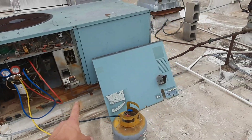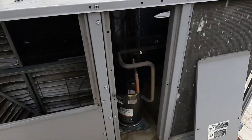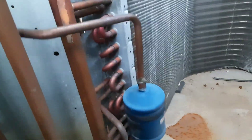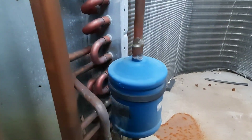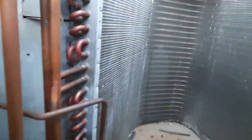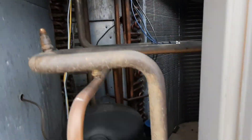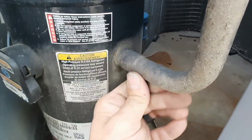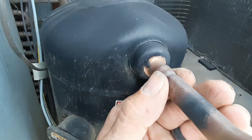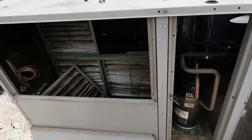If we walk over to the other one, this old unit has had probably 10 compressors in it — it's from probably the 80s, early 90s. This one here has not had a compressor replaced. That's a factory braze joint and a factory dryer. You can see there's no suction line dryer, and these joints look nice and clean as well — not filled in — so it's only been brazed once. Just some things to look for if you ever get an old unit like this.